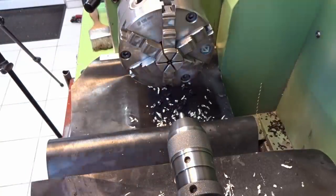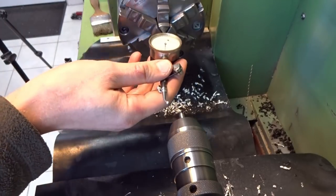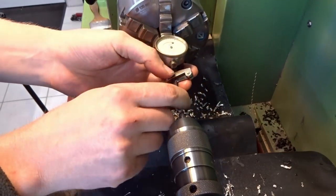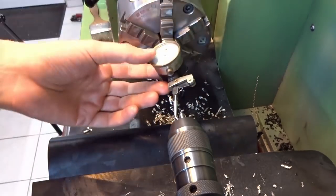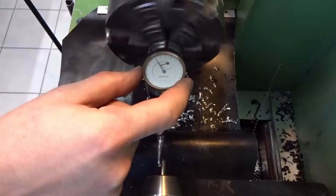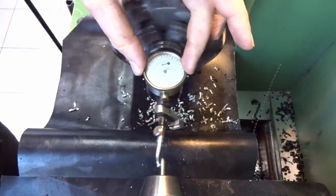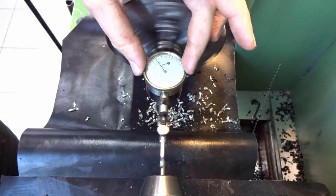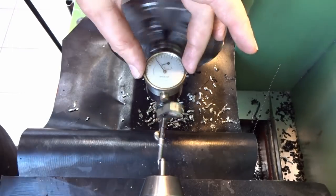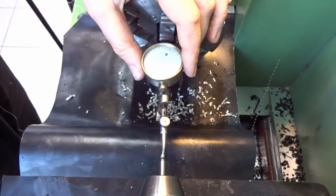If you have a coax indicator - one of these things - you can use that too, just be aware these tend to sag even more than a normal indicator. This wonderful instrument is made by Dia-test here in Germany. You can run these under power and as you can see with the Dia-test we are very close. When I move the cross slide it gets rapidly worse, and we can get it back to very tight. That's an option of course, but I don't use it very often to be honest. I'm a dial test indicator person - I trust them a little bit more because in these things there are many mechanical linkages and connections that all add up to hysteresis in the instrument.